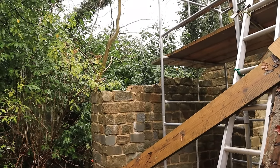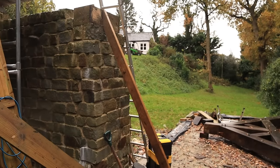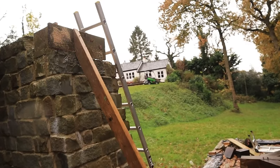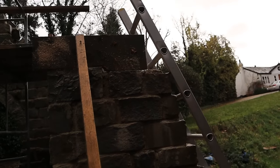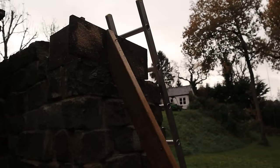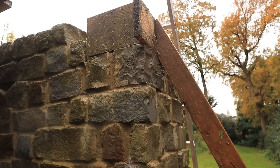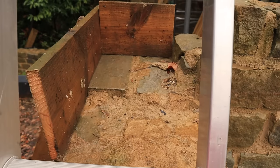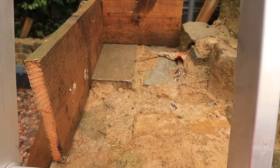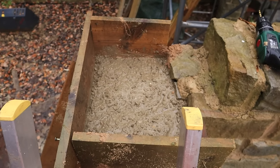The thing is though, you've got to stop the concrete pouring off the edge. This is more challenging than I thought. I've done one side — a bit of wood going up here holding in a bit of wood that I've cut approximately to size, but you can see the daylight coming through that crack. I've basically got to seal this off and pour concrete in it. I forgot to trim the rebar — it'll go in and stick out the top, it doesn't matter, it's just in the middle to hold it together. This is not a lot of fun. I'm doing this in the rain.